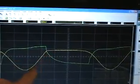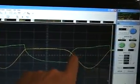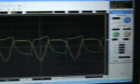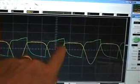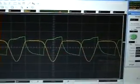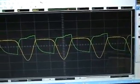The scope shot is very interesting — here's the period when the switch is on, and the energy is not coming during the on time. When the switch immediately comes off, that's the peak — it goes against the diode, which is why it's flat, then comes down to nothing before switching on again. Looking at a few more shots, you can see the on/off cycle and the energy going to the capacitor and load.